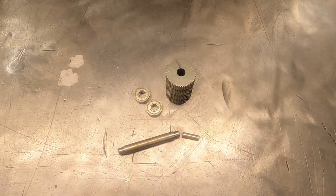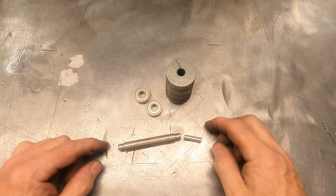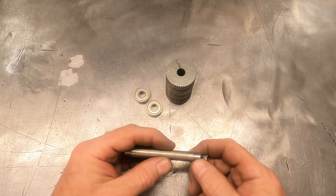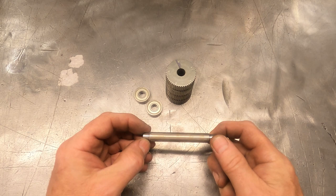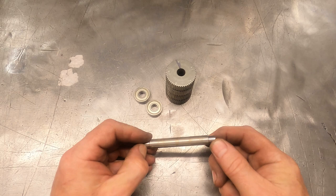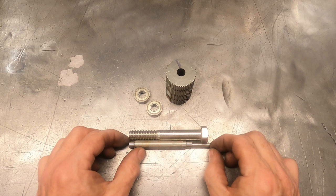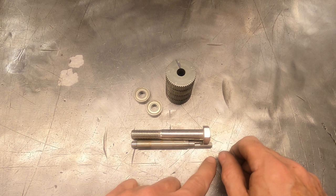We've got everything disassembled - here's where it sheared, it's stainless steel. I can't get new stainless today and I need the table running - there are customer orders pending. A replacement motor is on order but won't be here for days. I thought about using a stainless bolt, but it's just too short - there's no room to machine in the bearing surfaces and the needed length. The set screw would only have the width of that collar supporting it under tension load, and that's just going to break the next shaft.